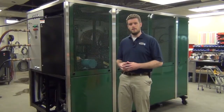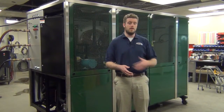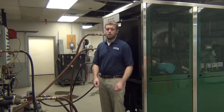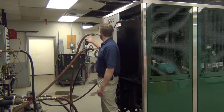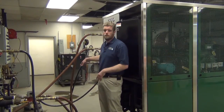These large drinking water chillers are typically installed on a concrete slab. Before putting the unit in place, you want to make sure that all the doorways and the clearances for the unit to fit where it needs to go will work. When the chiller is finally in place, you're most likely going to have insulated hard piping hooked up to all three ports: the cold water discharge, the return line, and the water in. The installing contractor is responsible for putting shutoff valves on all of these ports.